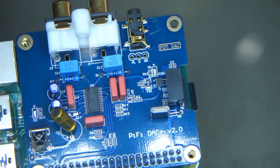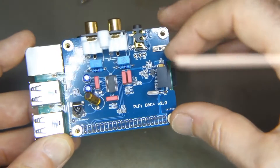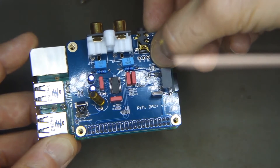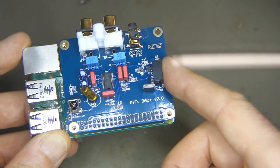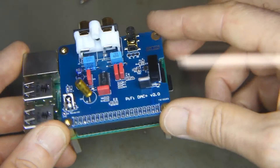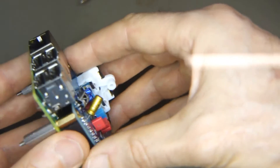As I plugged it in, I immediately noticed no lights came up on the unit. I believe this diode up here should illuminate. I happened to touch this component and it was too hot to touch — 60 plus degrees centigrade. So I immediately disconnected everything. Luckily I don't seem to have killed the Raspberry Pi, but this board is no good.